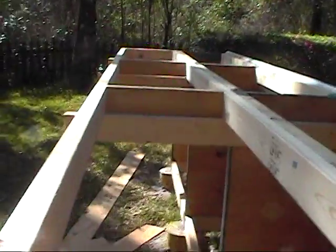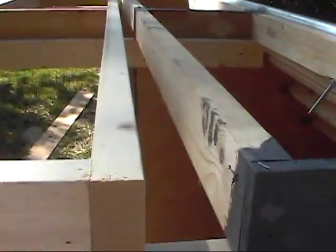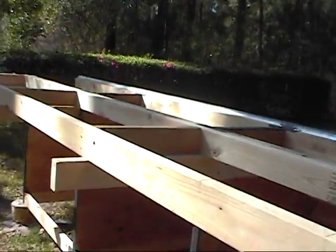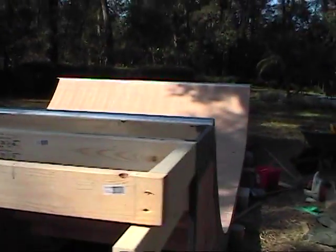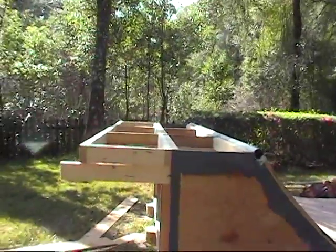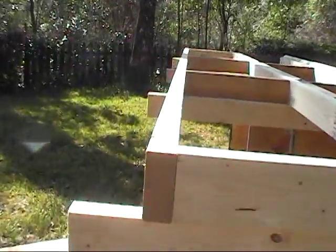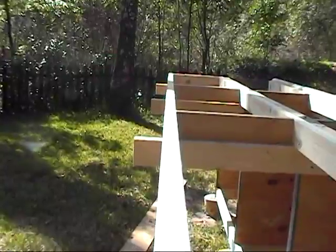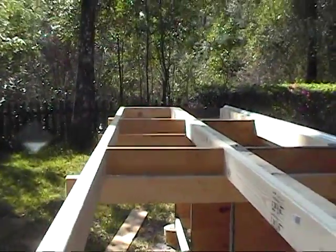Okay, I got the frame completed here for the top side of the ramp. Basically just make the frame. We're going to screw it right up here against the other part of the top to give us support for our 3/4 inch plywood on top. Basically it turns our 1.5 foot top to a 3-foot top, and these pieces sticking out at the ends here, this is where the 4x4s coming from the ground are going to be screwed into to support it from the back.